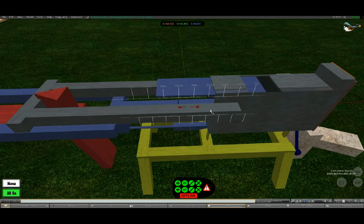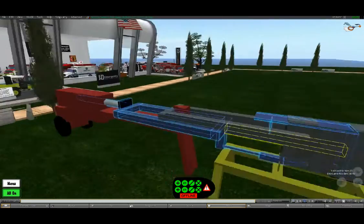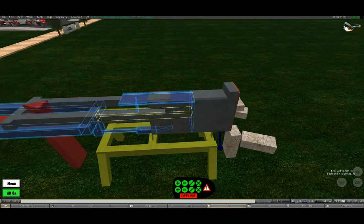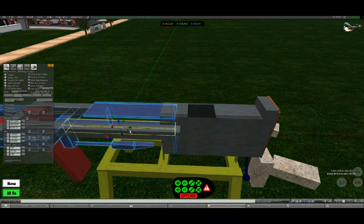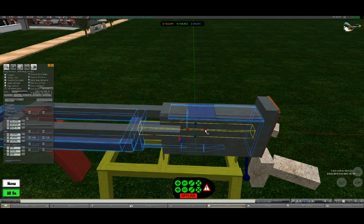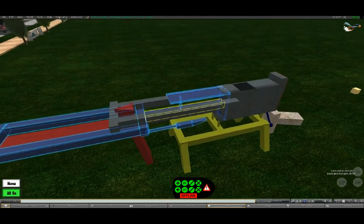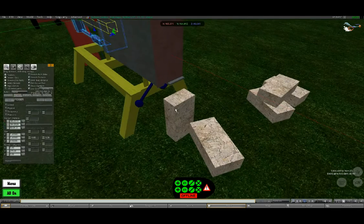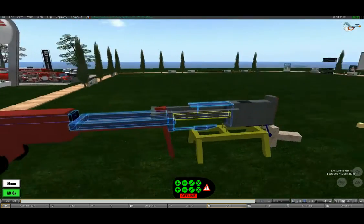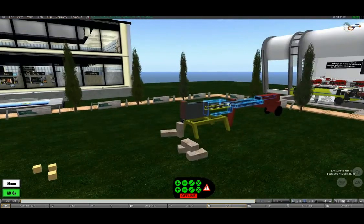So the whole process repeats itself and you can keep pressing bricks until your hopper is empty. It's a pretty fast way to make good solid bricks. The operating time for the piston to go forward is about 7 to 8 seconds, coming back about 12 seconds. So within 20 seconds you can press a brick that is 20 cm by 10 cm and 6 cm high — a pretty nice brick. You can press up to 3 bricks a minute, so 180 bricks an hour.